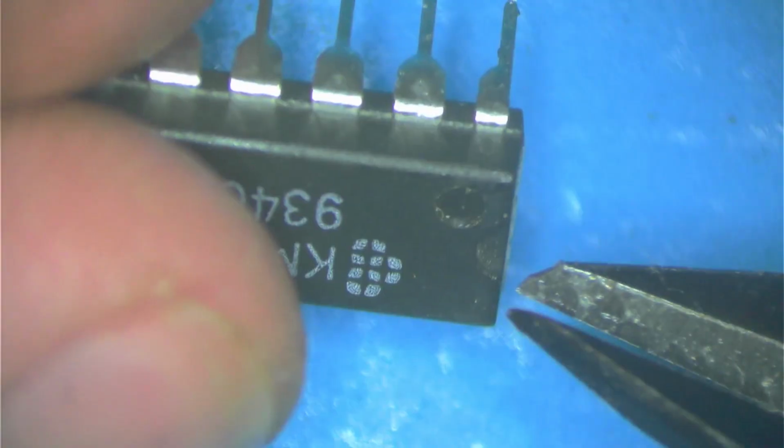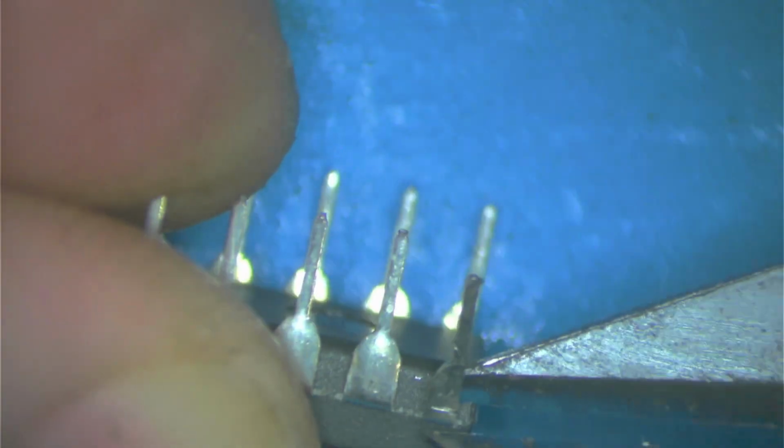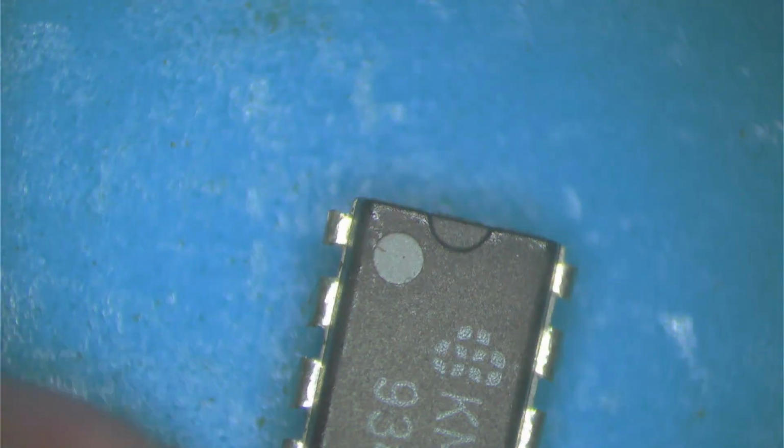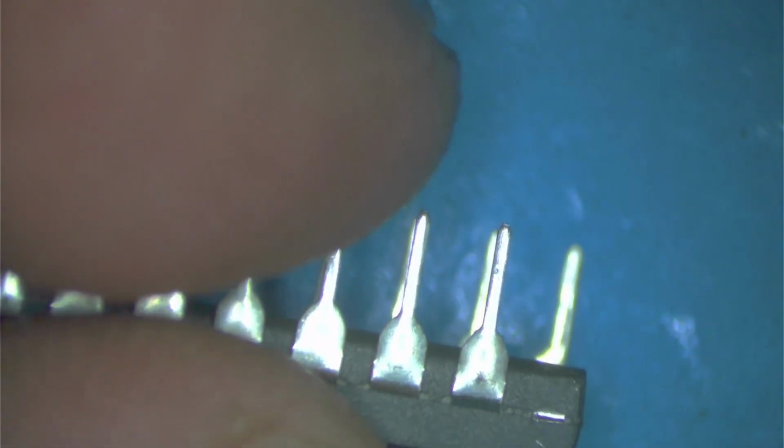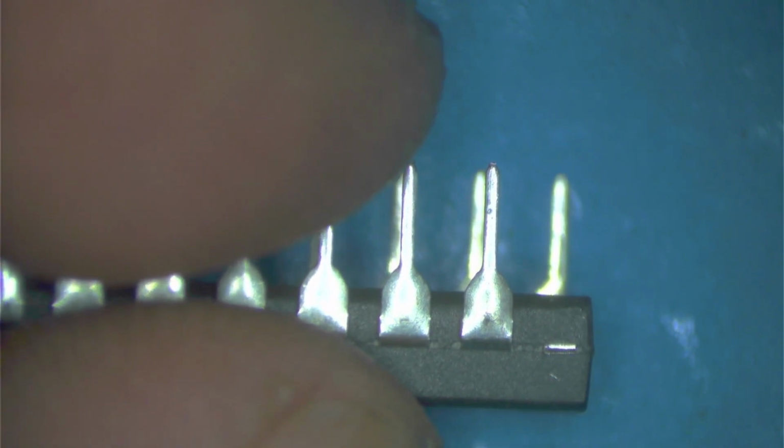Right, this one I do not need to save. Pin 1. Because on the board, pin 1 is 12 volts because this is a 12-volt memory card. So pin 1 on these chips is power, so that's gonna suck in 12 volts, and you don't want that. You're gonna fry it. Okay, so that is completely gone.